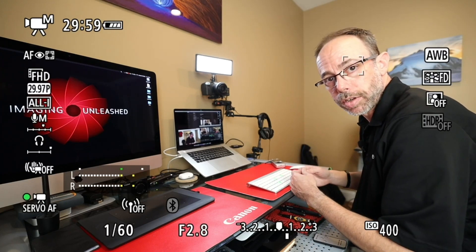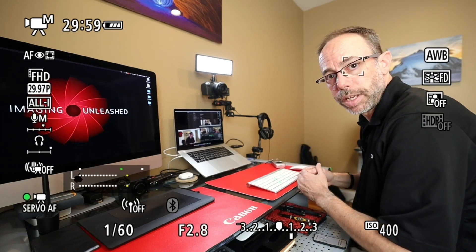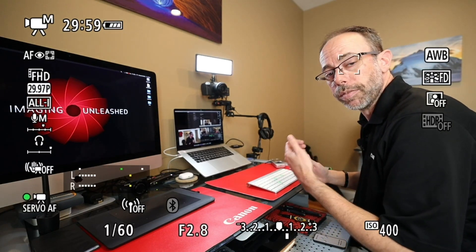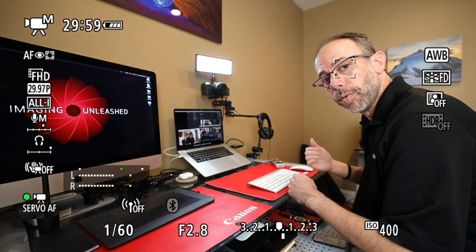Next, we're going to need a video capture card. This camera is outputting through the HDMI, but we have to put that signal into our computer somehow. The video capture card, easily found online, can convert that signal from HDMI to USB. Now let's see how the camera looks with the HDMI out to the video capture card. You can see right now that there is no autofocus information or exposure information on the screen — that's because it's a clean HDMI signal going to the video capture card.